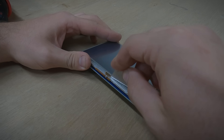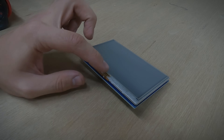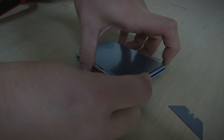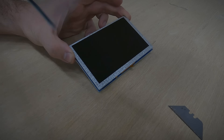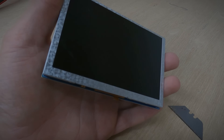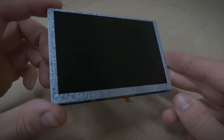I had to cut the ribbon cables for the touchscreen, since the circuit board is glued to the LCD panel and I can't get to the connector. Using a heat gun and razor blade, I carefully started prying the glass touch layer away from the display, and it was going pretty well — until it wasn't. So much for not breaking it. Oh well. The LCD panel still seems to be intact, so no harm done. I just have to make sure to blow off all of the glass dust so it doesn't dig into the panel.